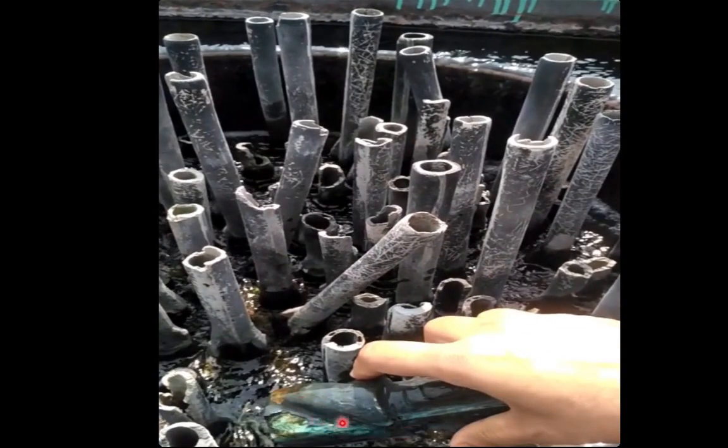These swirl inserts have a swirl kind of arrangement — while showing one of them, this pipeline is having these swirls. These swirls initiate flow of water in a helical form, so the water entering the tube on top of which this swirl insert is placed gets a rotational motion. Due to that rotational motion, water flows inside in a circular motion, increasing the time of residence for more heat transfer, and also maintaining close contact with the tube's heat transfer surface area. The water is not required to flow full in the tubes — it just has to be in close contact with the heat transfer area, and both of these are ensured by this swirl insert.